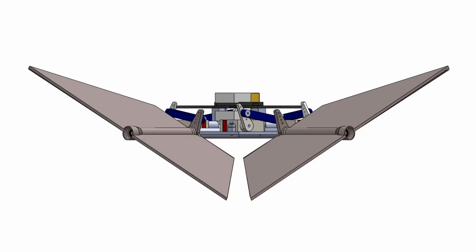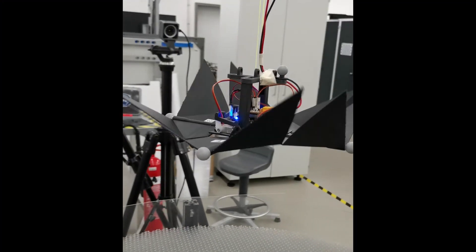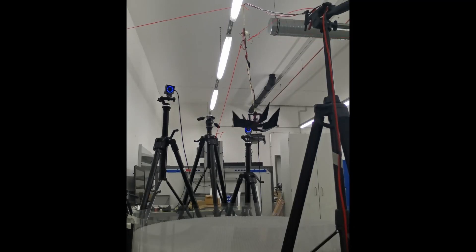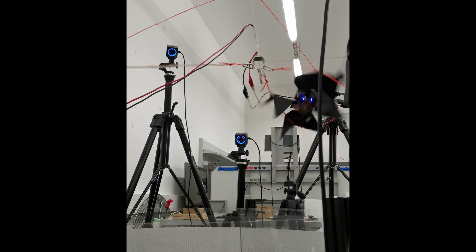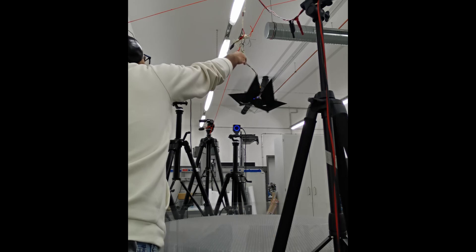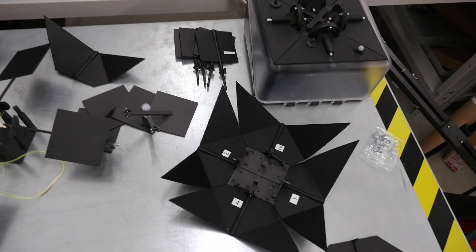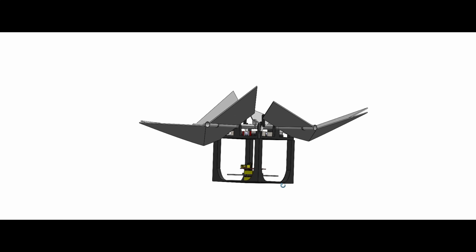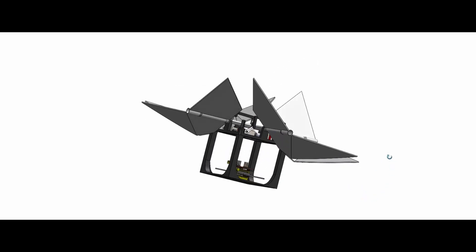To understand why, let's take a side view of the robot. From the pitch axis perspective, the robot is stable — if it tilts, the airflow corrects it and restores the original orientation. But from the roll axis, the opposite happens: if the robot tilts, the airflow pushes it even further. For the second design, I added kinks to the flaps to make the robot stable along both axes. Although this design was stable and could do accidental flips, controlling the pitch axis was more difficult and the design was far from good. After many designs and tests, combined with deep analysis and optimization of the robot's body and flaps, I finally arrived at a new design. The flaps are asymmetrical, with a kink on only one side, and to lower the center of gravity, I moved the controller and the batteries below the flaps, increasing stability during flight.